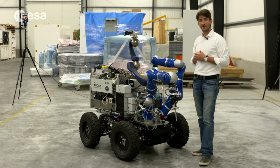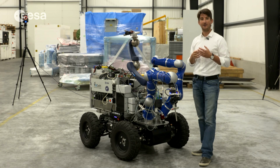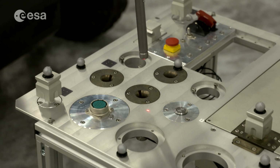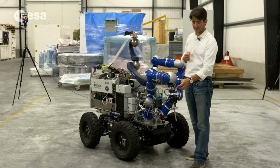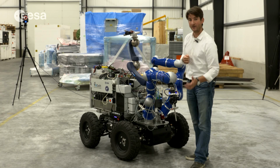The robotic arms of the platform are 2 KUKA lightweight robots that are controlled in impedance control mode, which means they can be compliant to the environment and relay contact forces in very high fidelity to your force feedback joystick. The robot arms comply to external forces. They're equipped with Cartesian force torque sensors, with a gripper, and they're holding the peg.